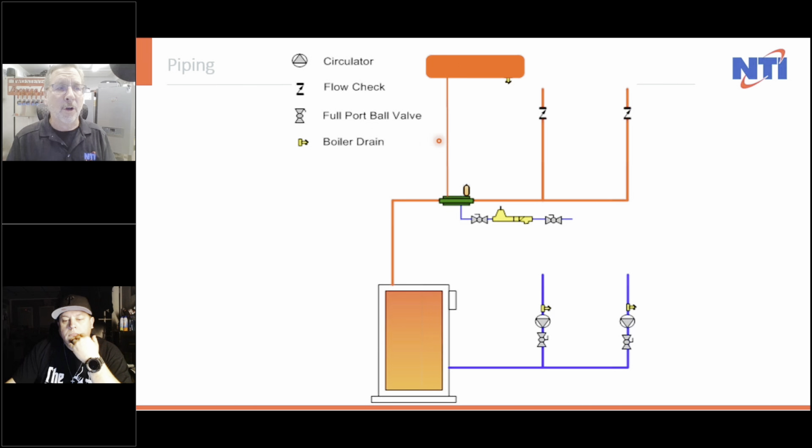The hot water goes up the pipe as it expands. The cold water comes back down the pipe. But while the hot water goes up, it cools, it absorbs the air up here and brings it back down and goes off in the system. This is why these tanks get full of water. It's not because there's an air leak. It's because of gravity actually flooding them.